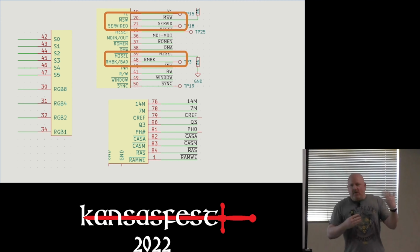The CYA or FPI, depending on which board you have, disables the Mega anytime address decoding happens, which is why I say this doesn't actually have anything to do with emulation on the 2GS. The only thing the Mega does is the video modes. Everything else is either in the CYA or the 2GS's ROM.